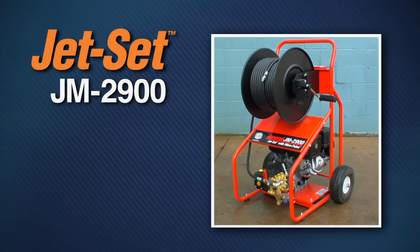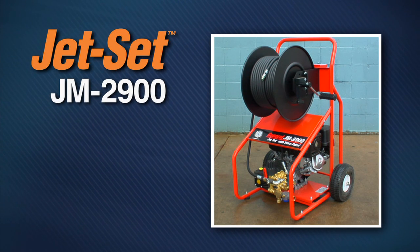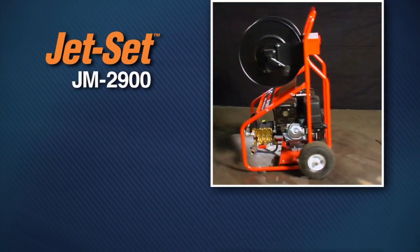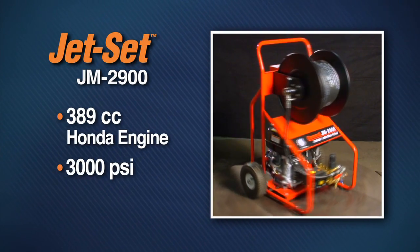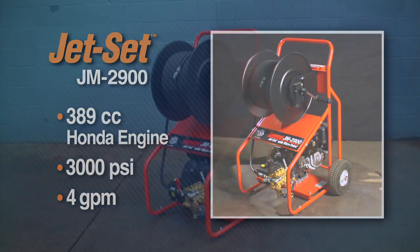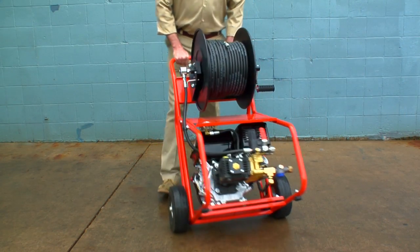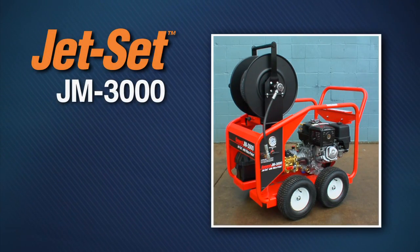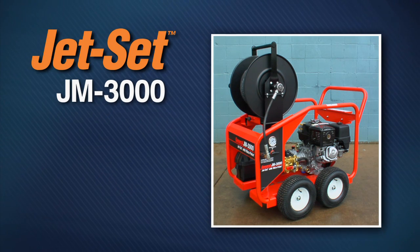The JM 2900 is an economical alternative to larger gas jets. It's lighter and more maneuverable, yet maintains the same flow rate and pressure as its big brothers. It's driven by a 389cc Honda engine, connected directly to a 3,000 psi 4-gallon per minute pump with VibraPulse. A 200-foot capacity hose reel is mounted on an easily maneuverable heavy-duty frame with 2 pneumatic tires. Built to take heavy-duty use and abuse, the JM 3000 is great for large lines and long runs.